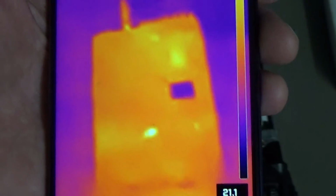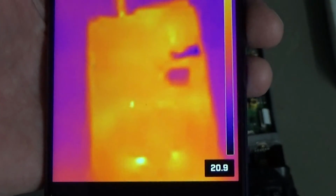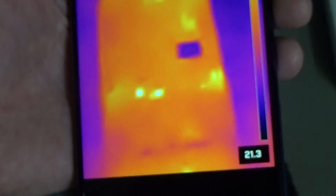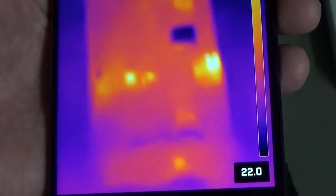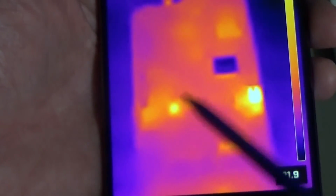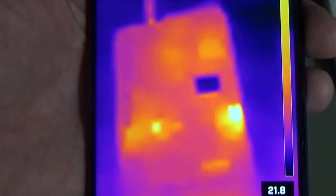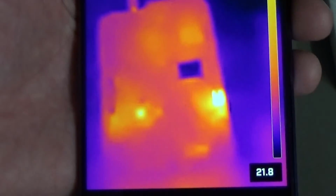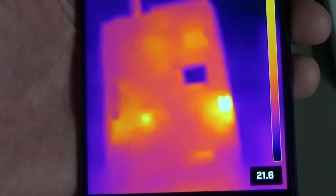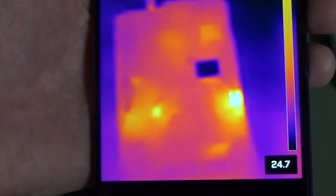And now let me simply switch in the FLIR once again to see what we can see here on the FLIR. And oh wow, to be honest, I do not... Okay, now we can see it as well. So of course we can see the voltage regulator here, and that is our MCU. But what you see as well is that you do not have details. So we only have a blob. So we see there is a hotspot, but especially our processor is not very easy to identify.